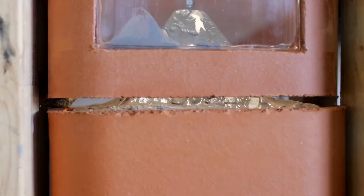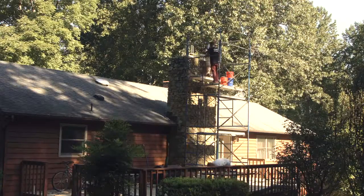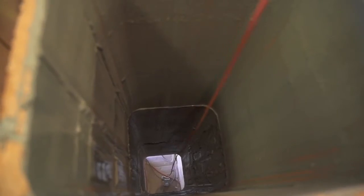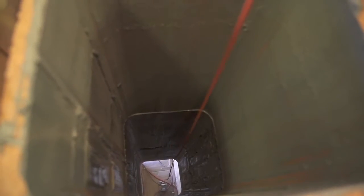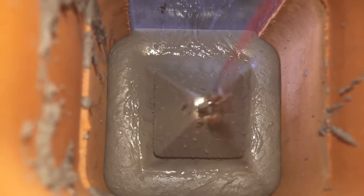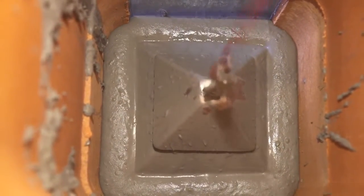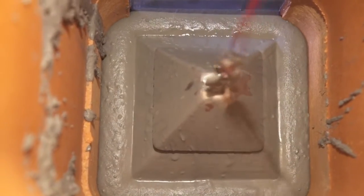The applicator is winched up the flue, filling open mortar joints or depositing a layer of material over fractures. For resurfacing, the base coat is applied and allowed to become firm, and then a second application is applied, which leaves a solid layer over the entire flue area. As demonstrated, the vibrating applicator causes maximum penetration of the FireGuard material through the joint and an even distribution over the entire flue area for resurfacing.